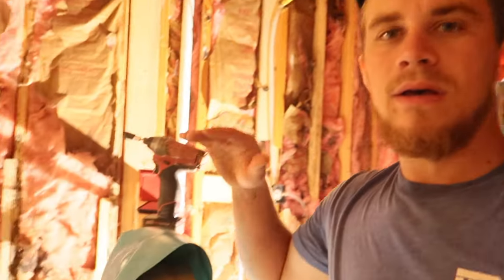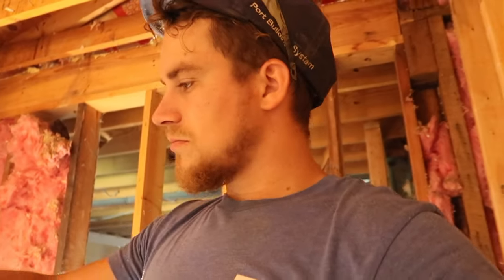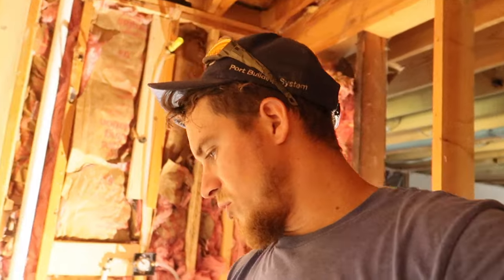All right, everyone. So the next step is going to be putting the liner membrane down. We got the pre-slope already done. It's got almost a half inch of fall on it to the drain. So I got a pretty thick membrane. I'm not even sure the millimeters of the thickness of this thing, but it's 9 by 6 and we got a 4 by 7.5 shower. So we got plenty of room to come up the walls and plenty safe. And so we're going to do that and let's get started.